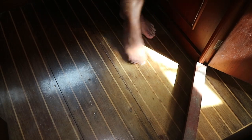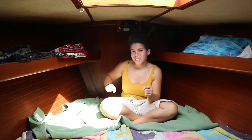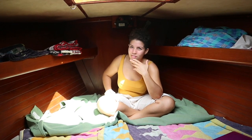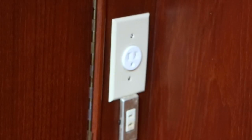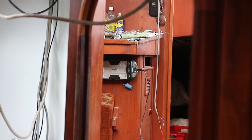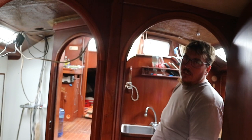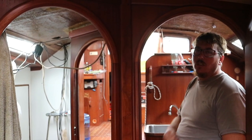We had six inches of memory foam in Rosa and now we have none of the original — we need new foam. I like to remove things like these AC power plugs, because of the higher voltage and fire risk. I believe all AC wiring should be centralized on the boat — less wire, less fire hazard. You only have two pieces of wire instead of it sneaking through your boat, because anything that crushes a wire can give you a fire.